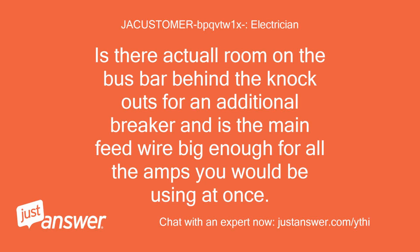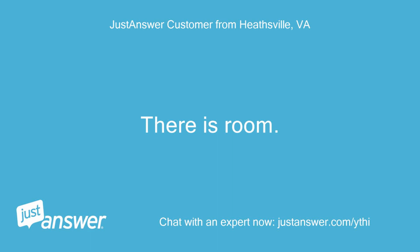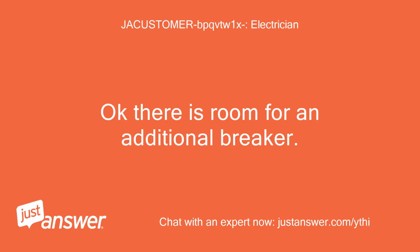Is there actual room on the bus bar behind the knockouts for an additional breaker, and is the main feed wire big enough for all the amps you would be using at once? Is this the main panel in the house or is this a sub-feed? There is room. Okay, there is room for an additional breaker.